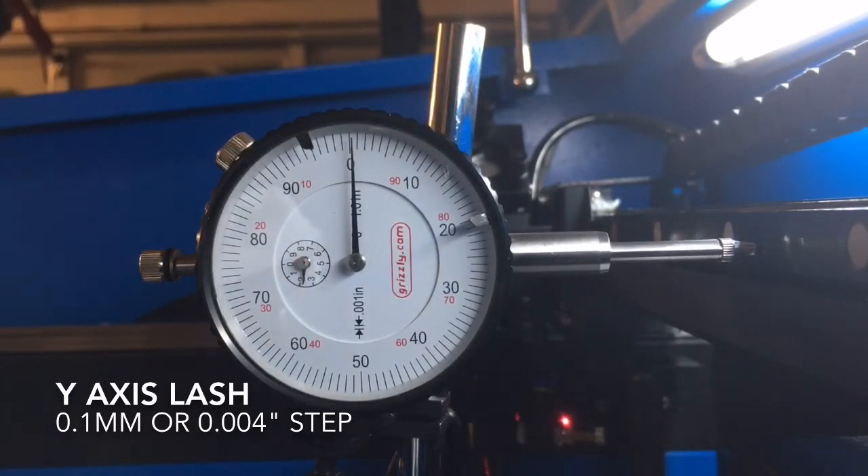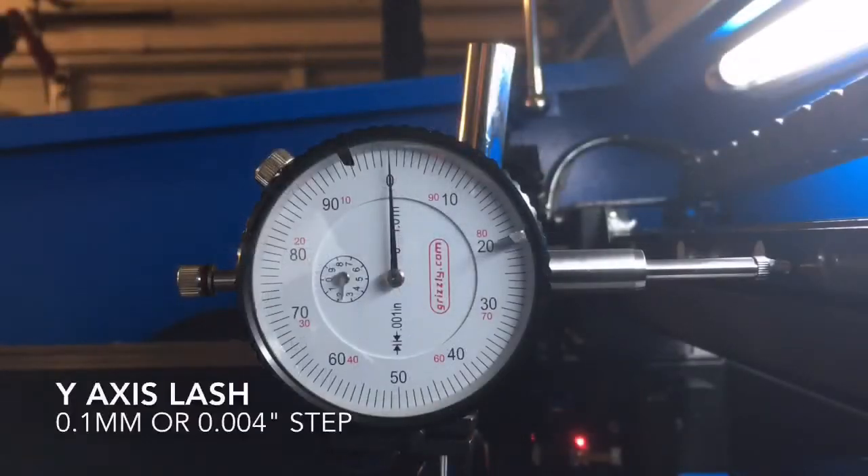So I think this would explain pretty clearly why it doesn't cut clean circles. Here's another test where I'm going to dance around the zero, going up and down a tenth of a millimeter at a time, which is roughly 3.9 thousandths of an inch, or 4 thousandths on the gauge.